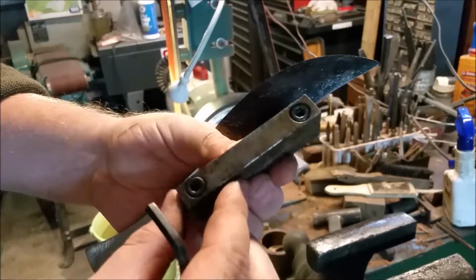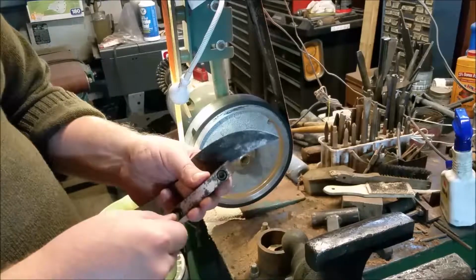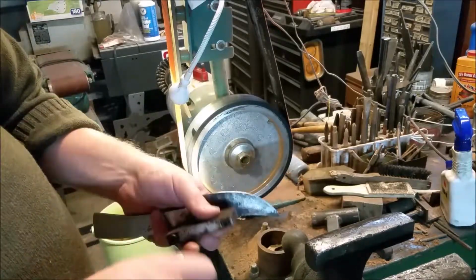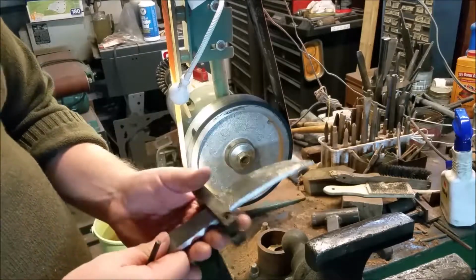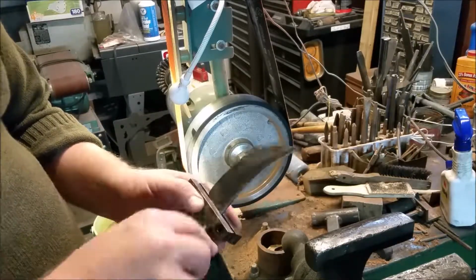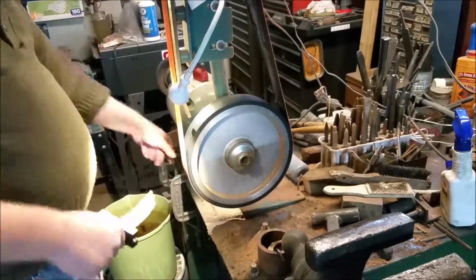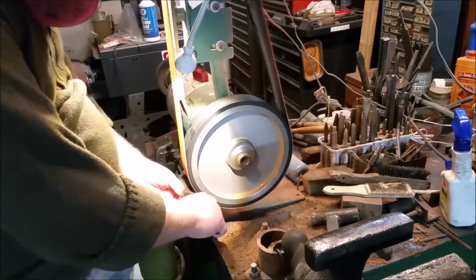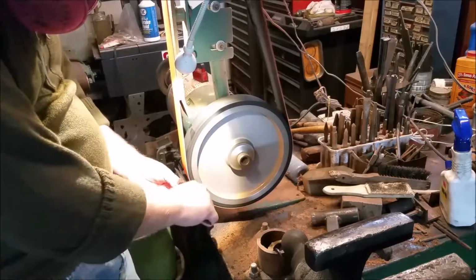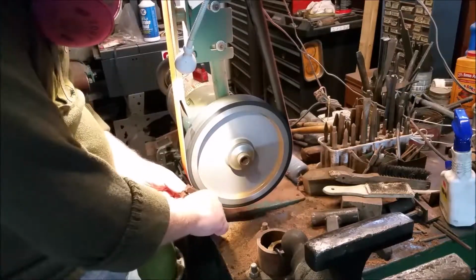And now we're moving on to our preliminary bevel grinding, and this is a little file guide that I bought from USA Knife Makers or someone, maybe an Uncle Al, I can't remember, it's been a few years ago. But this makes a huge difference in your initial grinding and getting your plunge lines lined up. This might be probably one of the only fixtures or jigs that I use. Not that I shouldn't use them, but I just haven't built very many.